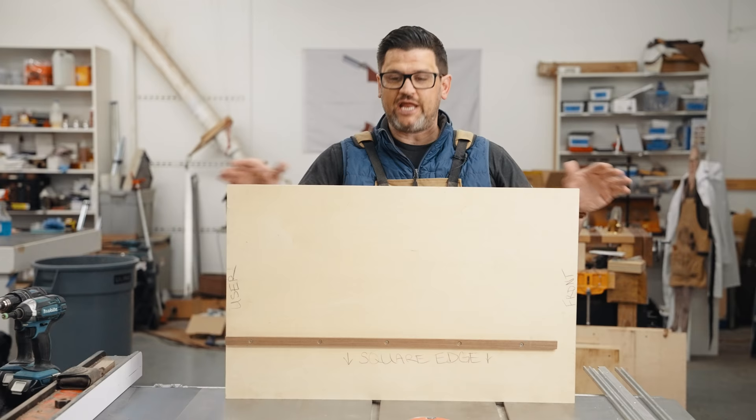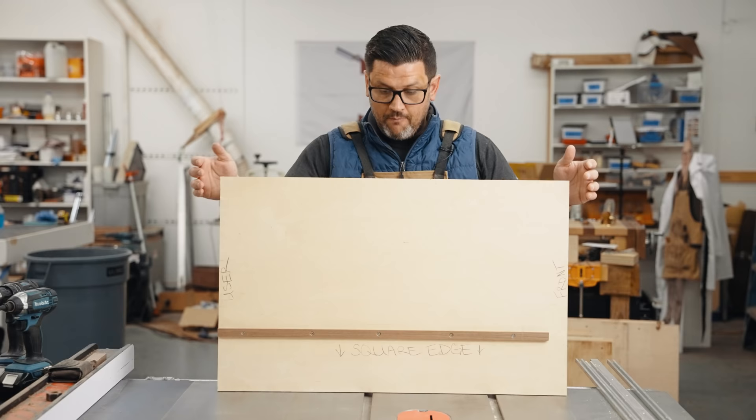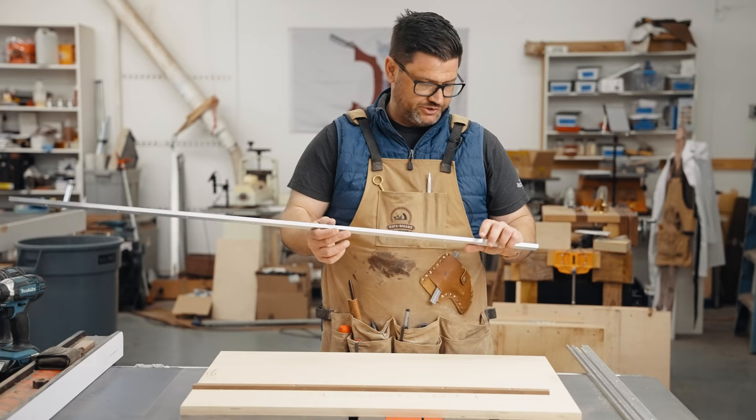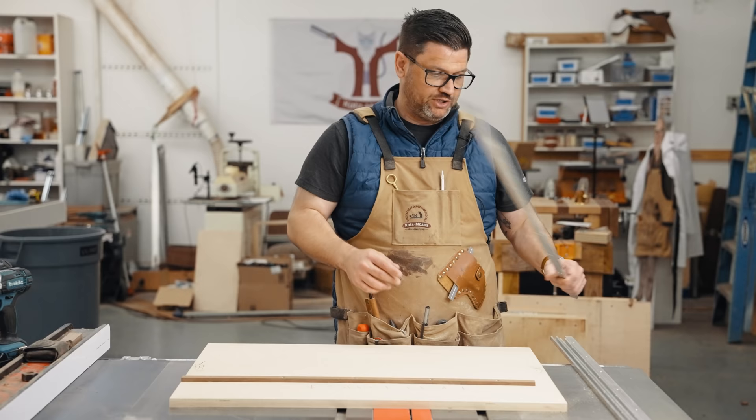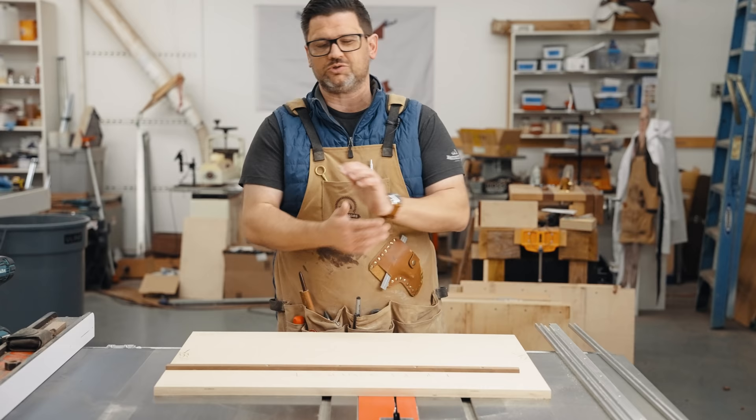We got our good edge now, and that's important — you want to protect that, don't drop this on that edge. We're going to put in our T-track. I'm going to be using this great T-track I found, which is one of those rare, really high quality and really cheap T-tracks, which I'll link below. What I love about it is the bottom's really thick and the holes are not only drilled but countersunk, so you don't have to do any of that. They're really easy to just screw in, or you can epoxy them — usually I do a combination of both.